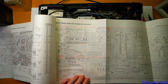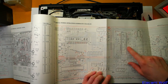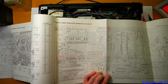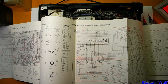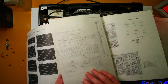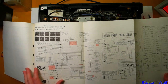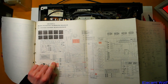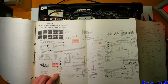We'll check the pass-by on this chip and then that reset output — it's got a 0.1 mic there — reset active low. So we should check those. Check the power to the chip, then we'll check the clocks. Get the scope on. And then from this point here there's a power on signal which goes out to the other stuff. So I think that was what's saying that the power is always on, which is what's powering up the rest of the VCR. There's a power on input which I think just comes from that button, from the power switch. There's other ways of powering it up — the timer record function can power it up, and inserting a cassette can power it up.